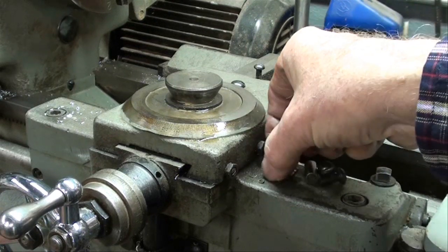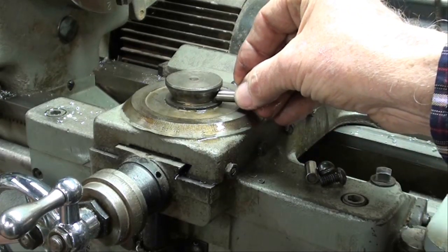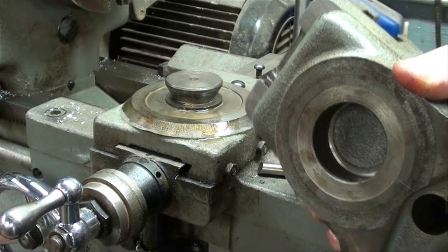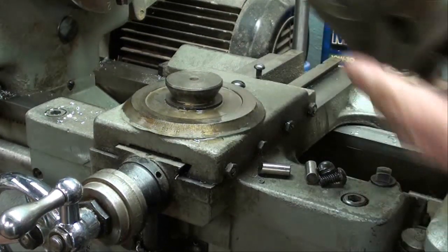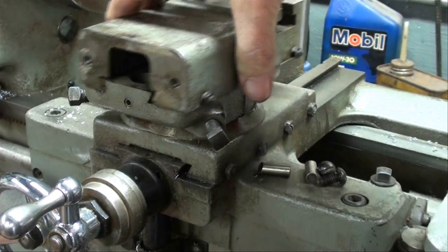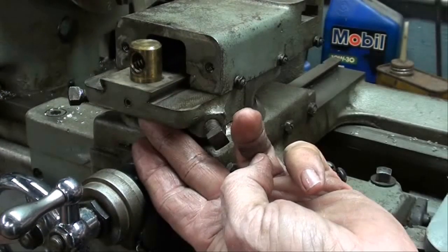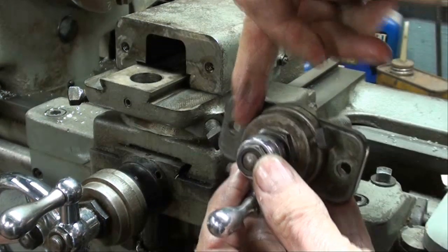When we put this compound back on here, these little hardened pins have an angle on the end. They go in there like that — they will be in the bottom of the compound, one on each side. These square-headed screws push those hardened pins in, and that's what locks this when you tighten them up. The brass nut simply goes in here like that, and I'll tighten the set screw with an Allen wrench. Then we can thread this in and tighten those two screws right here.